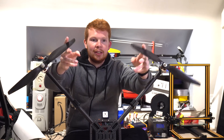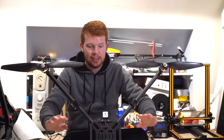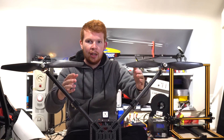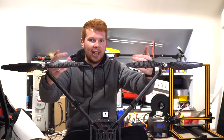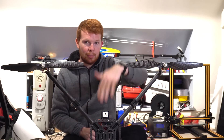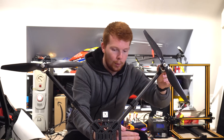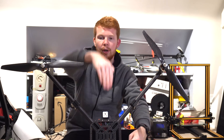The reason I have such long arms with propellers that don't come near each other is that I want a section in the middle of the drone where there's not much airflow coming down. That way, if I want to lift and drop a plane from there, I'm not blocking a lot of the thrust if I put a wing straight through the middle or up here.